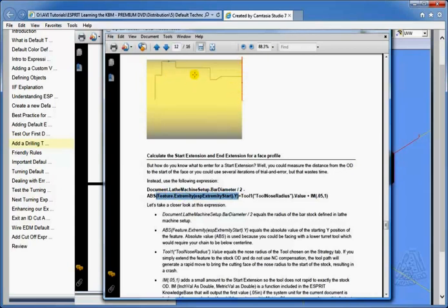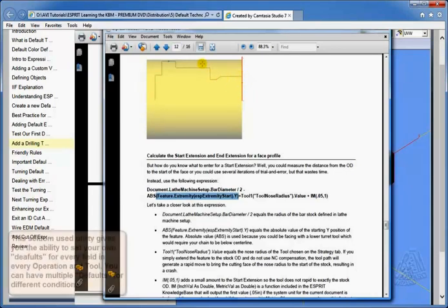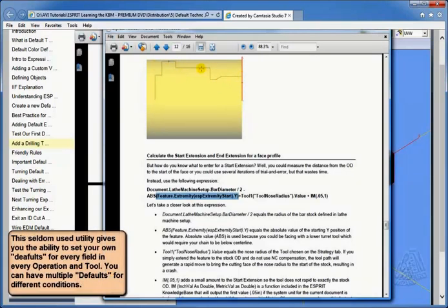If we look at any feature, and this is showing a turning feature, that feature has a start point, a middle point, and an end point. We know that already because we can get those properties in ESPRIT. If a feature goes all the way to the end, we know where it starts, where the midpoint is, and where the end point is. And we know that in each axis: where it starts, ends, and the middle in x, y, and z. So this phrase can be beneficial to us.